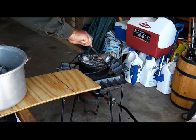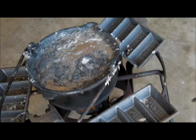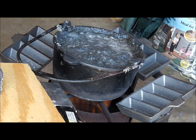It's all white now but in a second or two it'll all be nasty black. You can see the other stuff I showed you earlier - this came out of there, all the brass eyes and swivels and stuff. You can see it's turning black now. I'll just scrape it off and we'll go to pouring some bulk lead. That's the nasty crap right there. Okay, we've pretty much got it ready to go now. Let's start putting some of those molds in.